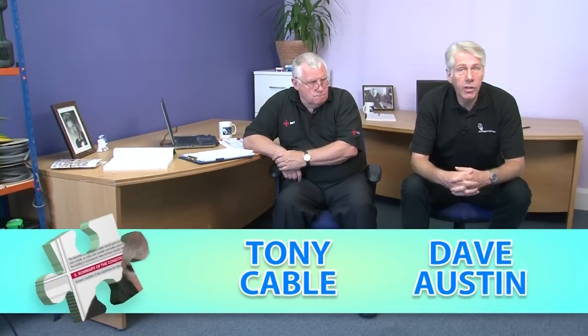In this video we're going to look at how to undertake an electrical installation condition report, as introduced with amendment number one of the 17th edition of the wiring regulations, in this case on a dwelling. It's important to point out that this is still periodic inspection and testing, as required by chapter 6-2 of the regs, and the electrical installation condition report form replaces the old periodic inspection report form.